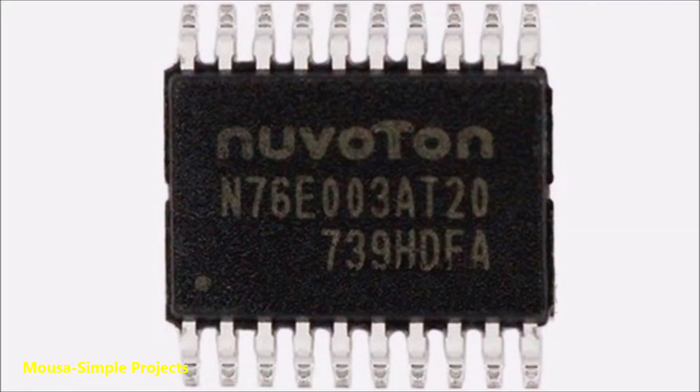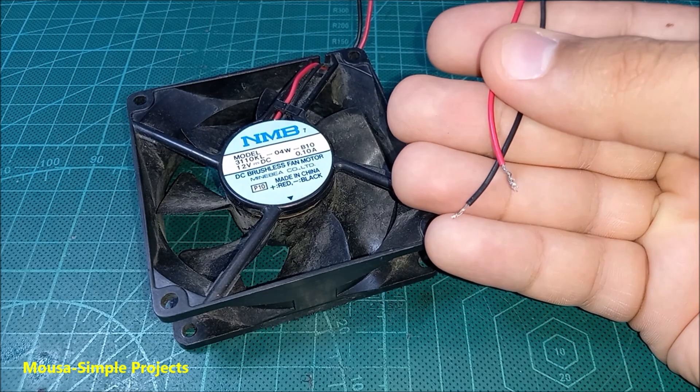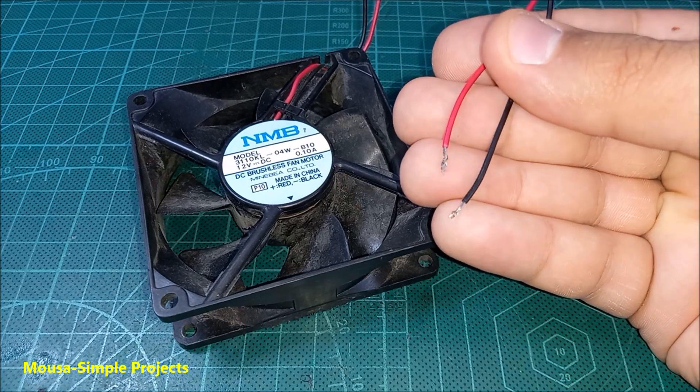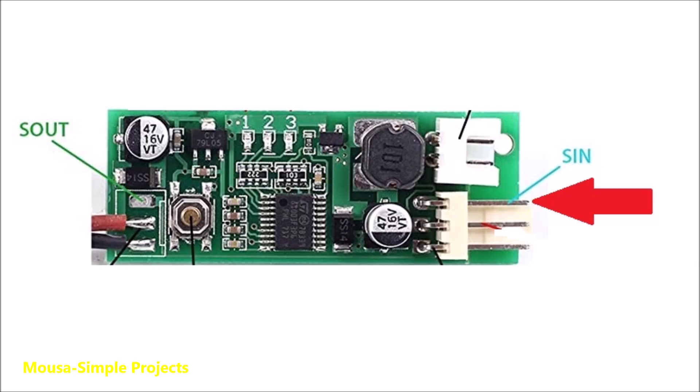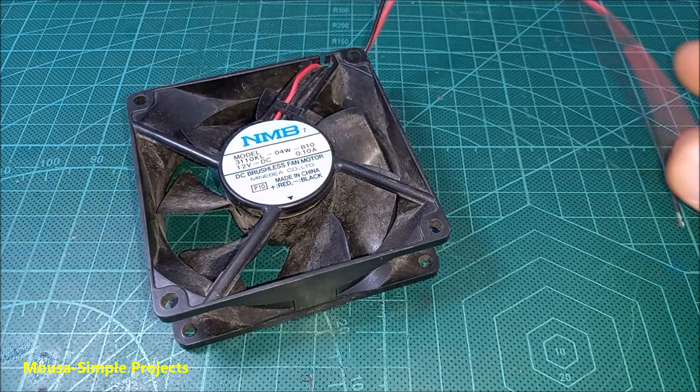This one has an 8-bit microcontroller IC. The wiring is so simple — you just need a 12V power supply and a fan, as shown here. This fan here has only 2 wires, so the third pin is not used. By the way, this is not the fan of my inverter; I use it just for this test.